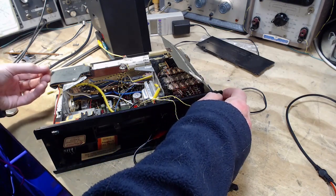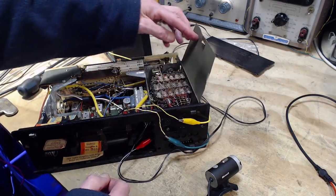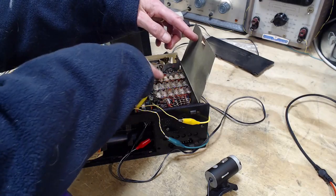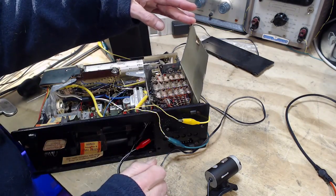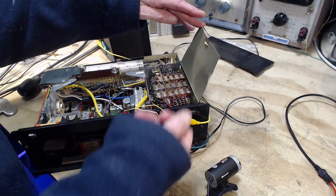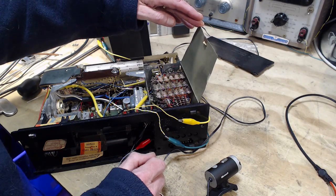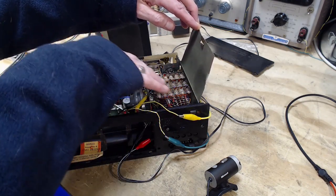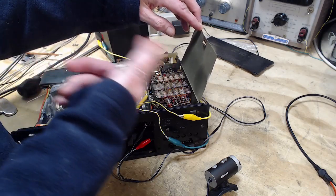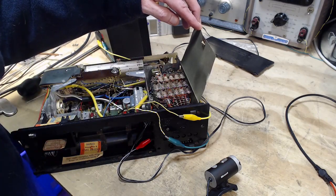Well, one of the things we can do here is we can always turn on the radio, and by interfering with these coils, we can figure out which ones are oscillators. Could do that, and then know which one's the oscillator and move it. But what if that's a mistake? What if all this stuff is kind of aligned properly, and I move the oscillator out of alignment with the other coils